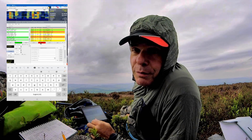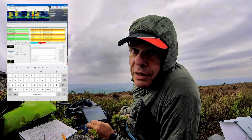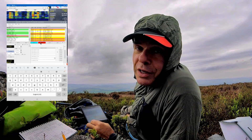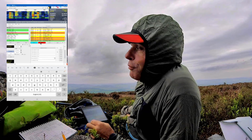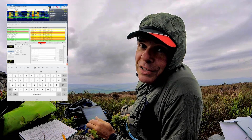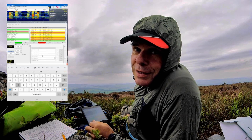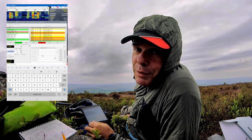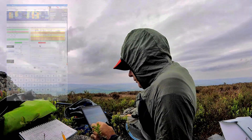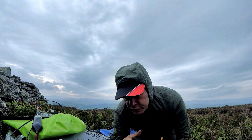Once you've got this software set up, you can use any data mode — PSK31, or with a Yagi 6-metre beam up here you can do Meteor Scatter with MSK144, or even Earth-Moon-Earth with JT65. They're all on the software. It's only limited by what you're prepared to carry to the summit. Let's try some 2-metre sideband to finish the day off.